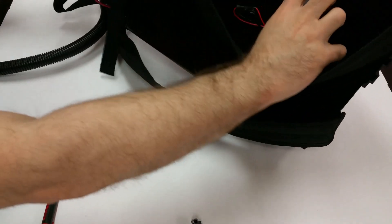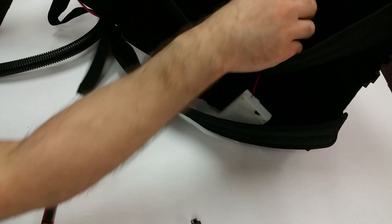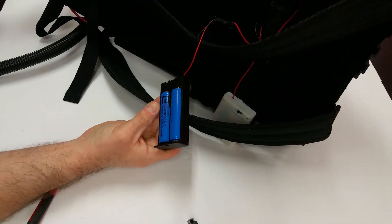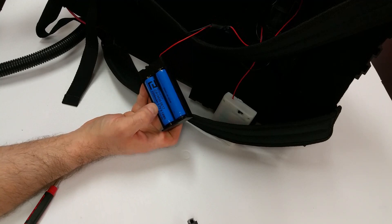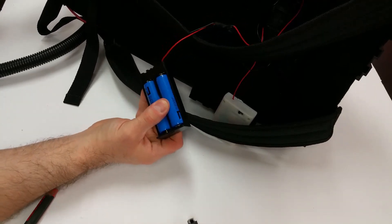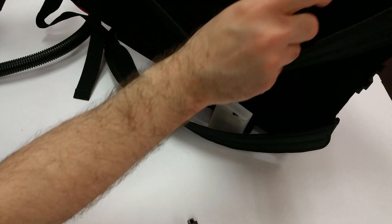Now we'll take a look at the battery. The battery pack that comes with the prop is just three AA batteries with an on/off switch — not quite enough power to operate the laser. So I needed to give it its own power system. This is an Elegoo Robotics battery harness that I recycled from another project. These are 18650 batteries, 3.7 volts each, and they're both powering the laser — a lot of power, which is what's generating that heat. It was a lot easier to do these as two separate electrical systems rather than integrate them and worry about parallel circuits. It's also a lot safer that way, and I can maintain my batteries separately.